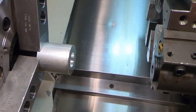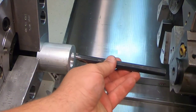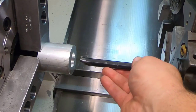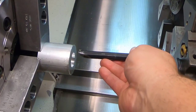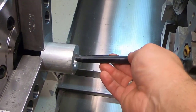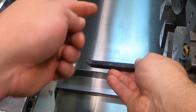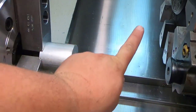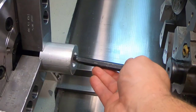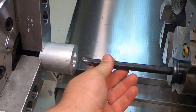The thing that's very important when you're using your boring bar is I want to do all my cutting on this top edge right here. So what that means is whenever I start making my shifts, I'll be going in the X positive direction to make my hole bigger. I need to make sure — just like on the insert drill — that the furthest cutting edge, in this case I only have one cutting edge, is pointing towards the center of my turret, so that the outermost side of my cutting tool is cutting on the top or outside of my material. So I'm going to go ahead and load that in there the correct way.